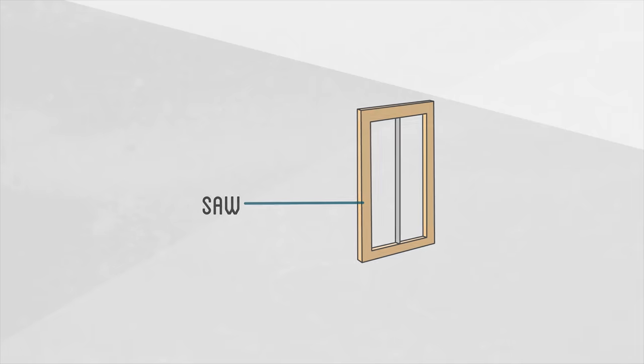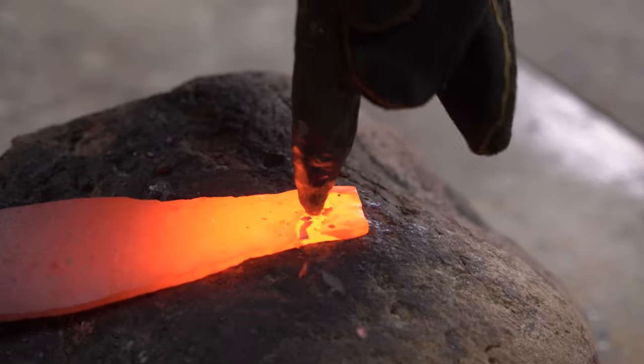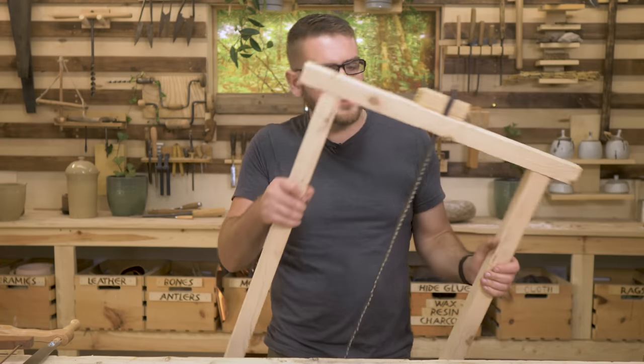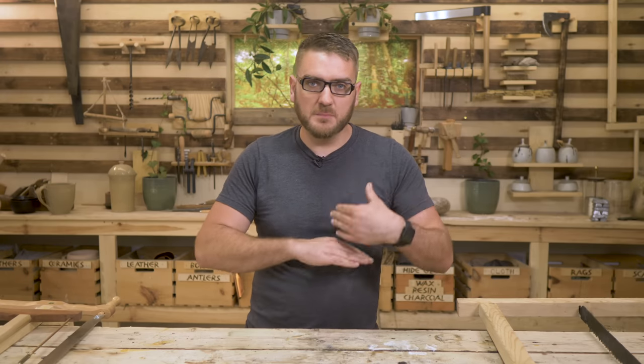For the build of this tool it's going to be four main components. First up is the actual saw and its frame — we've already forged the saw previously in the initial sawmill project video, and then we built this frame when we used it in the pit saw, so this section is pretty much done. After that, the second part will be the body — basically the frame that will hold the saw and provide a track for it to go up and down.